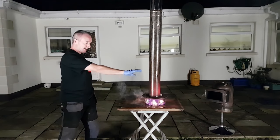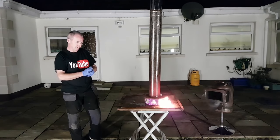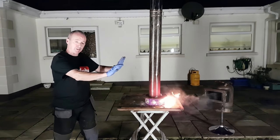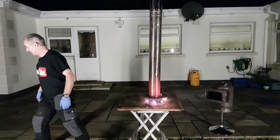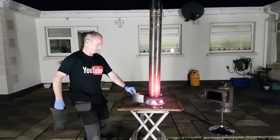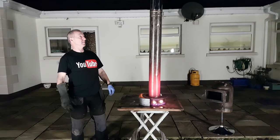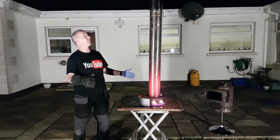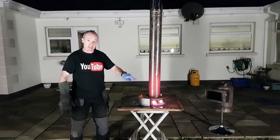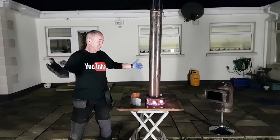Maybe you can see it — it's beginning to get red now. So it's too windy. What's happening is the wind is blowing the combustible gases away. Let's see if we can fix that. You can see it's behaved now — it's not smoking anymore. But my problem is the wind is quite powerful. You can see it's red hot. All we would have to do is introduce a drip feed system into that and we have a waste oil burner. Simple as that.